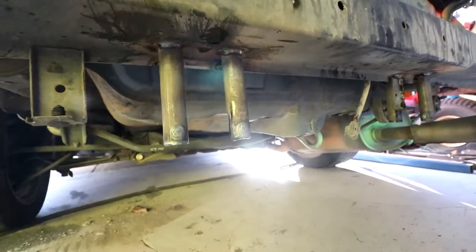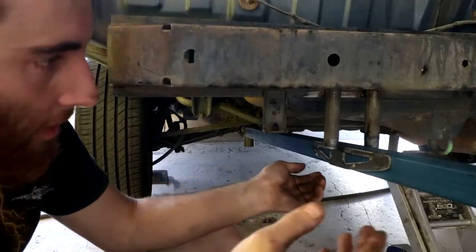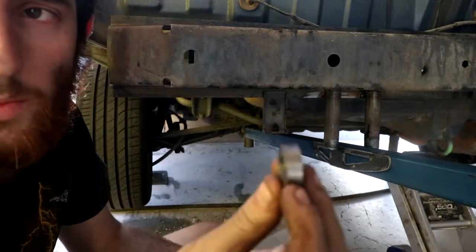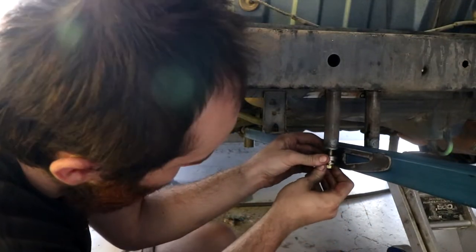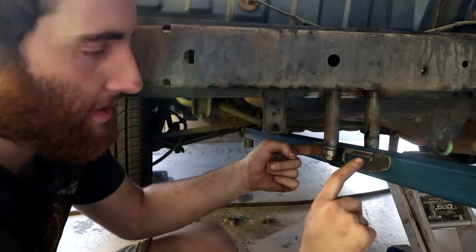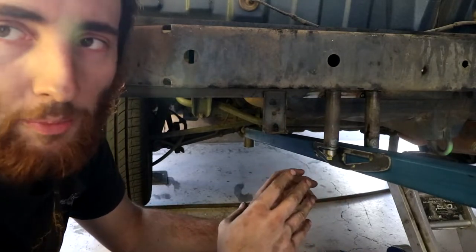So this is probably pretty over the top, but I can be happy knowing it's not going to pull the inserts out. So we'll bolt up the bottom bits and get our two mount washers mounted. Right, so our bottom piece is bolted back underneath. What I do now is our washers that we have to weld on, I can bolt these into place. Once those are bolted in place, I can tack it to this piece and then remove it and weld it completely, and we know that they're going to line up exactly.